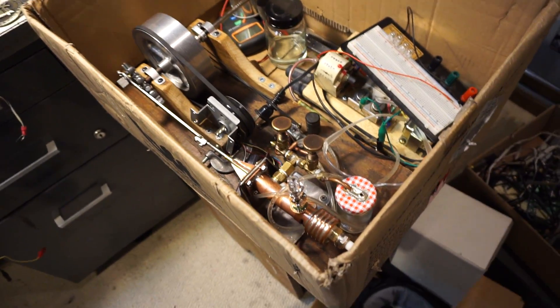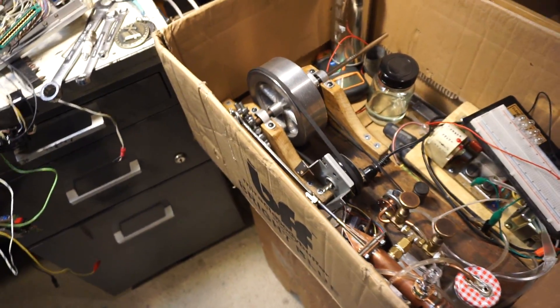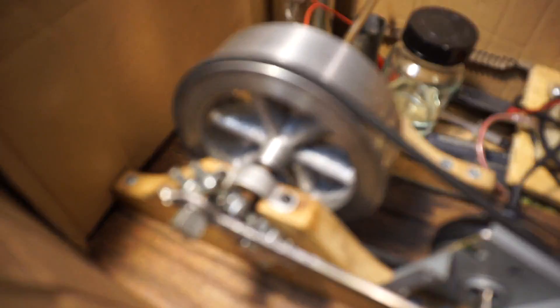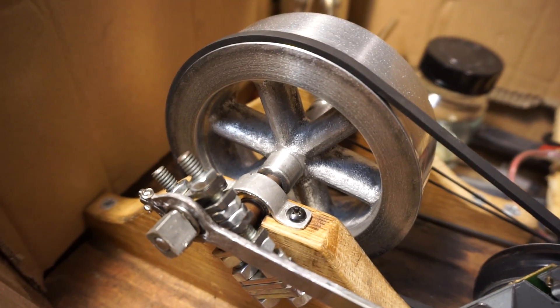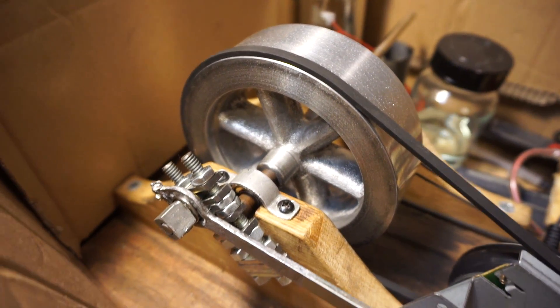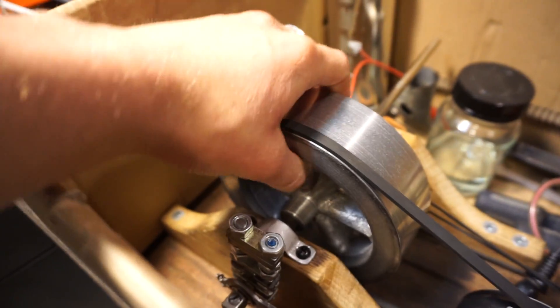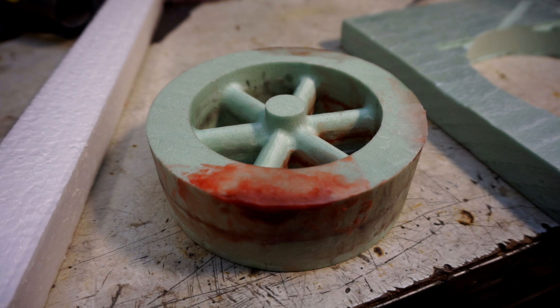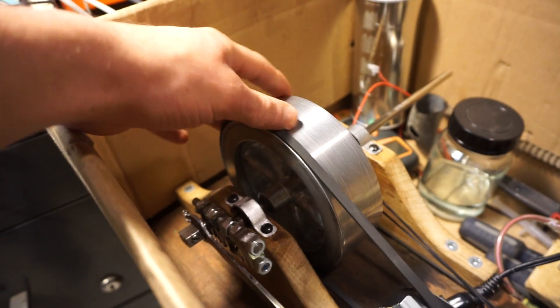Here's the state it is in right now. I have not actually run it in probably two weeks or so. But here is a new flywheel I cast for it. This is cast out of aluminum. I basically carved it out of high density styrofoam on the CNC mill at Hack Pittsburgh. I took two halves of it — I'll insert a picture, but I'm going to have a whole video on that if it turns out. I did cast this when it was dark out, so I don't know if it's really going to turn out.